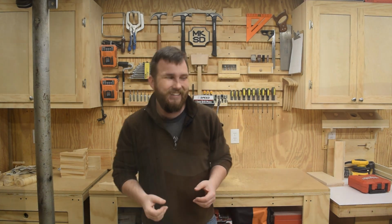Make sure you don't throw away those big cutouts. We use a 1.5" Forstner bit to make recesses that'll hold tea candles, and everything's gonna need a little bit of sanding.